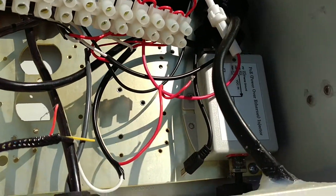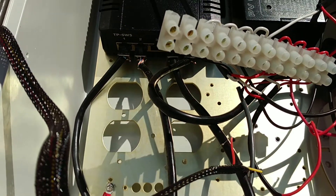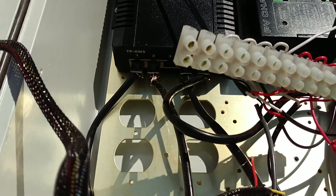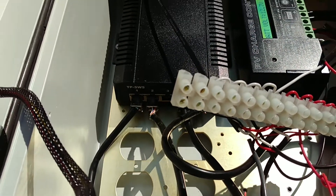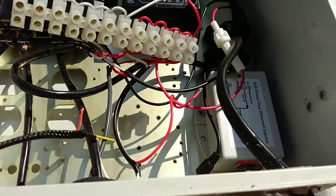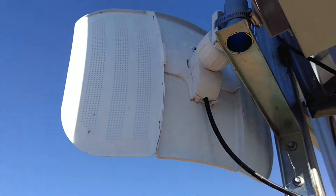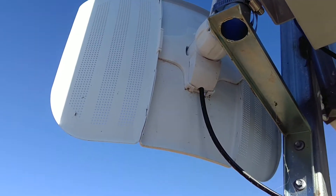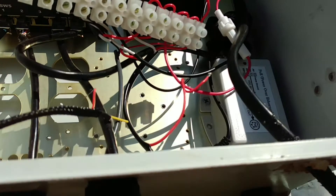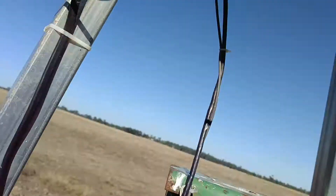These little things are just because the switch is actually 802.3 AT for Power over Ethernet, but the Ubiquiti stuff runs on passive PoE, which is just 24 volt. So you can get a little converter to provide power, or it will run on 12 volt too.